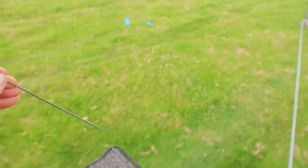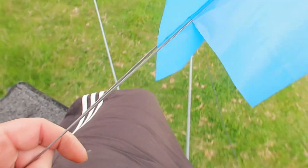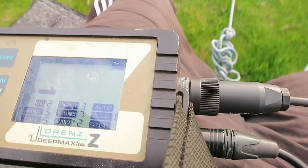The simple rule: if the coil isn't a differential loop type like the big 2x2, then you use a GND mode to balance the ground electronically. Phase four — the essential setup checklist for the Z2 with the big coil. Four key parameters to lock in for both stability and depth with the 2x2 meter double loop. First, mode: must be DEL3 as your default starting point — only consider DEL4 if the ground is super quiet electronically and you need that tiny extra sensitivity. Second, AUTO: set this firmly to zero, meaning off. With a huge coil moving slowly over large areas, you absolutely do not want the machine automatically retuning its ground balance mid-search pass.